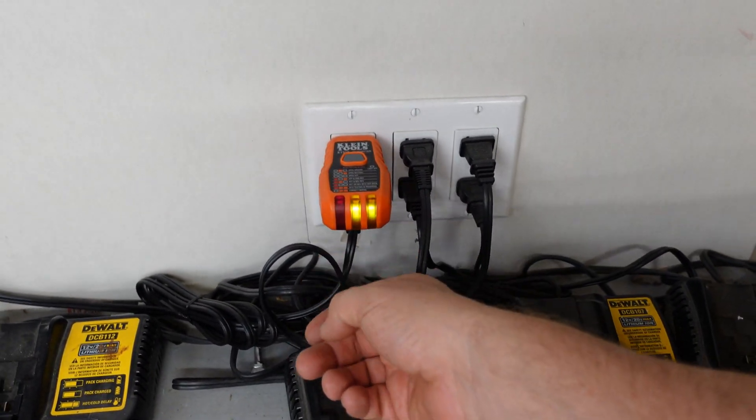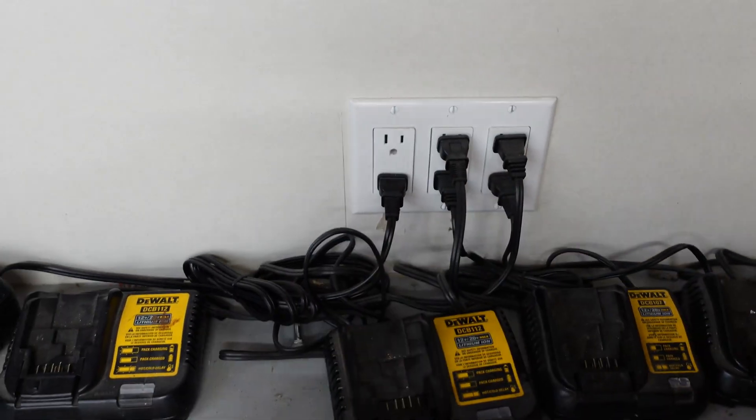You can see the trouble one can get into with broken meter leads - especially if we're testing for resistance or checking a circuit and we think the circuit is no good, or we're checking voltage and think it's dead when it's not. That's why it's extremely important to use two methods: a voltage meter and a volt-tick, or a plug checker. Don't ever depend on just one.